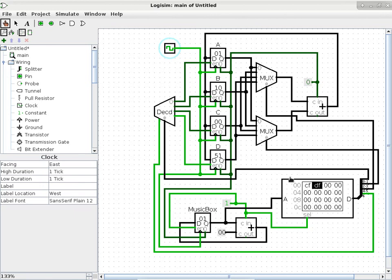So the essence of this entire discussion is to do branching that makes a program smart, because that's what you need to do conditional branches, conditional statements, and loops and stuff like that. It all boils down at the gate level to multiplexers. And the input of the selection of the multiplexer would be certain flags that reflect the result of a comparison or a subtraction. The only one that we have seen so far is the borrow out after a subtraction, but there are other ones as well, as we will see later on in the semester.